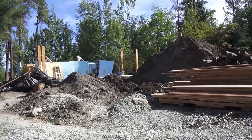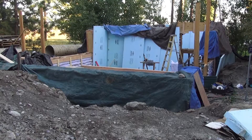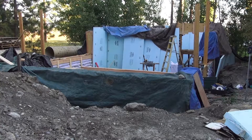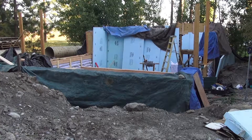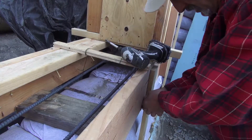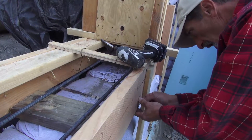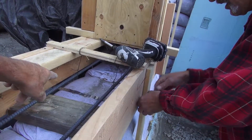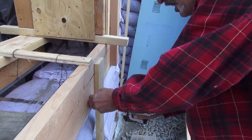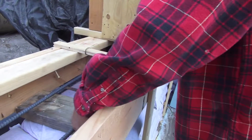We're getting ready to pour the concrete bond beams, which are on the top. They're called bond beams because they bond everything together and they're going to give us a nice even surface to frame the roof and the walls. You can see here that Gary's attaching a piece of metal plumber's tape across the bottom of the form — he's got it attached on this side to the outside of the form, ran it underneath, and then he's putting a screw in on this side that keeps the forms from spreading on the bottom.